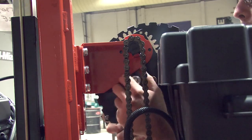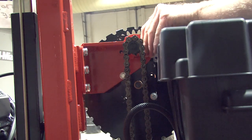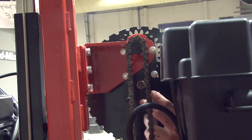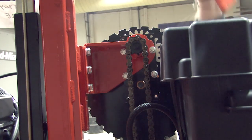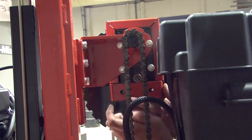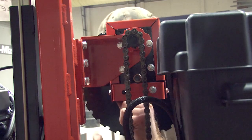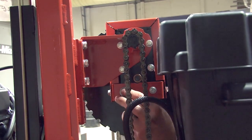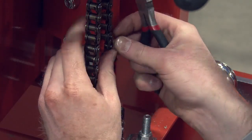After rotation, remove the bolt nearest the center. Line up the bolt holes and replace this bolt, now going through the orange bracket. Replace the three other bolts in this area. With those four in place, remove the fifth bolt on the bottom that was left on earlier — there will be two empty bolt spots at the bottom. Place the provided orange cover over the exposed gears. Take the lower portion of this cover and place over the last two remaining bolt holes. Secure into place using the bolts that came from the gearbox and orange cover — there are four: two on the front and one on each side. Be sure to tighten these bolts. Replace the chain to its original position and secure back into place using the master link that was removed earlier.